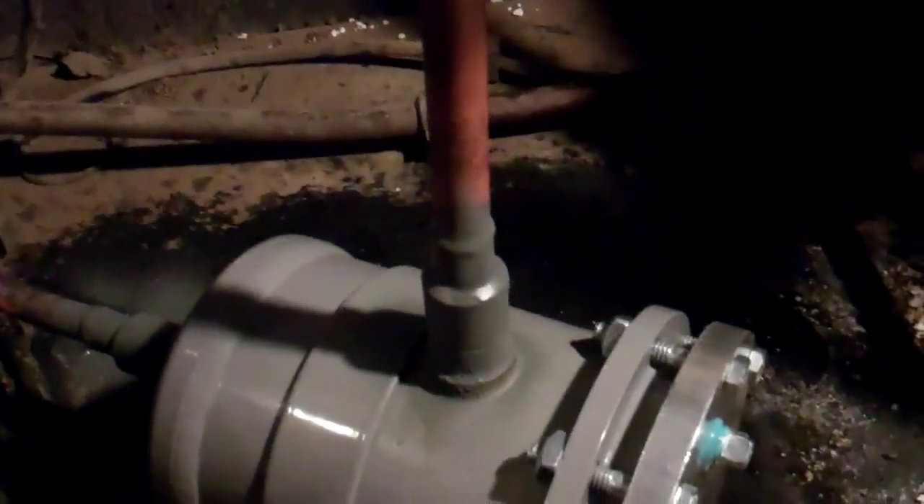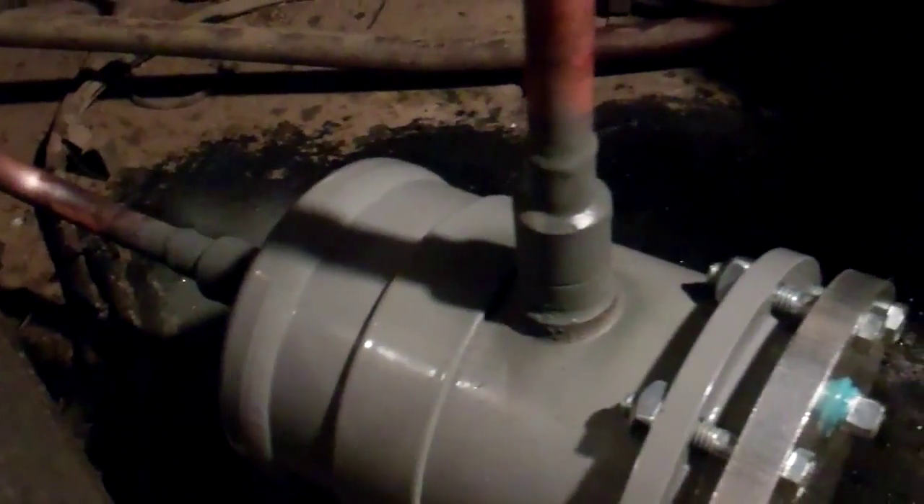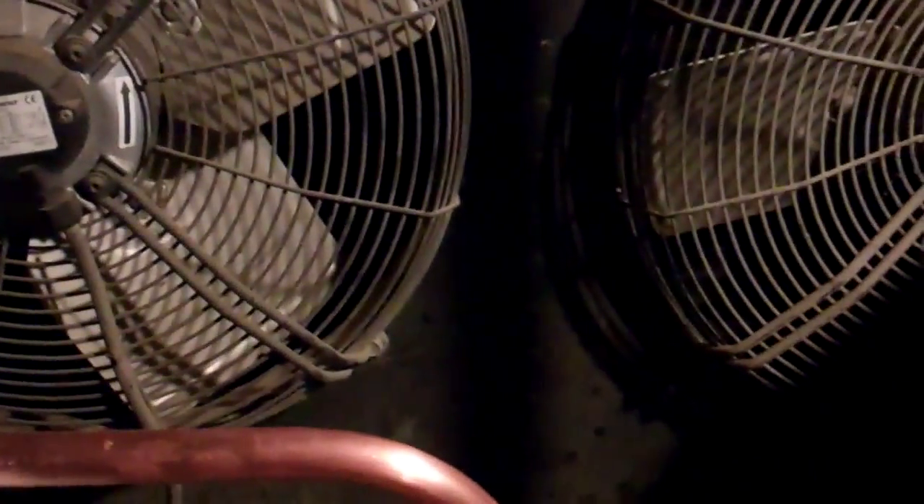It's just cooled its first lot of milk down. Put some paint around here where I've brazed it to stop it going musty. There's a bit of condensation in there still — that'll dry out eventually. It's had a bit of a tide mark in it. I think where they'd stored it, it was under water — that's why we had to replace all the terminals at the bottom because they'd rusted out. And then we've got to change the fan speed control because that's died.